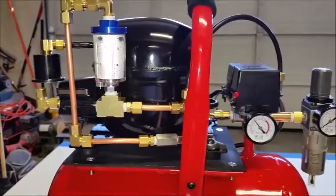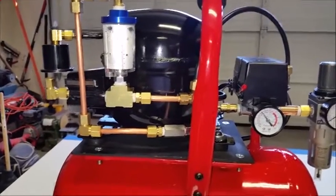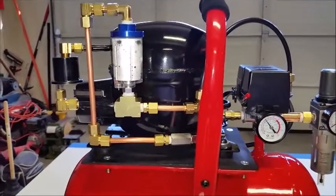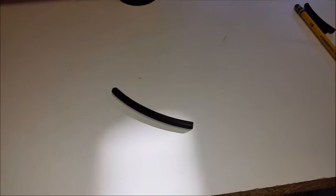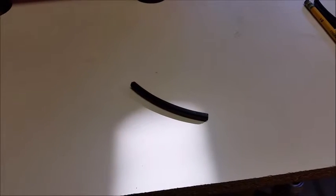The easiest way that I found, that I'll tell you, to cut this copper tubing to length is, copper's expensive. And if you don't have that much of it, or you have just enough to get your project done, what I use is just regular drip irrigation plastic line. And I measure the lines out with that. Then what I'll do from there is I'll cut the copper, just mark it, put it up against the pipe and mark it.